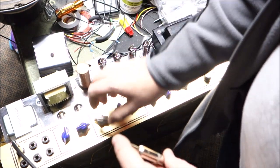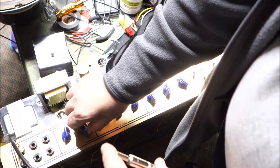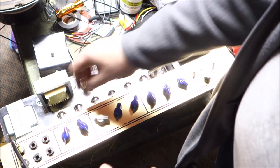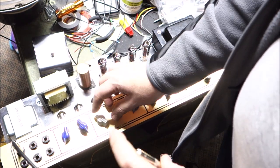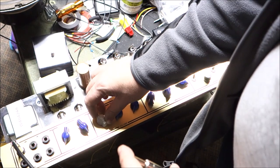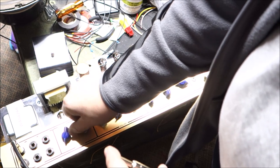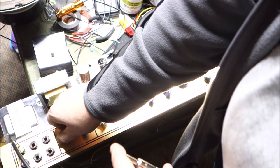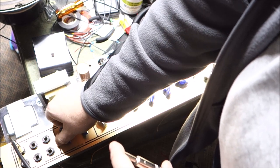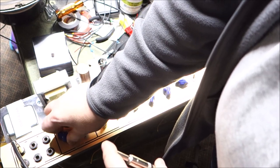And then if I... Is it pull for tremolo? Yep. So we should have a lot of depth. Squeak, squeak, squeak. Let's turn that. Yeah, shallow. Very intense. And then speed, slowest to really fast. And it seems like we got a little bit of fizz at the end of our pot, because our speed does funky things at the top end. Got a little bit of dirt in that pot.